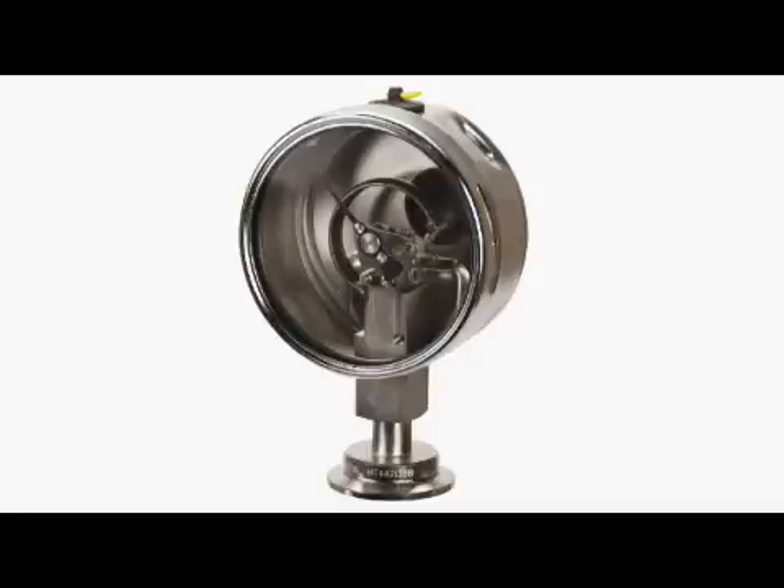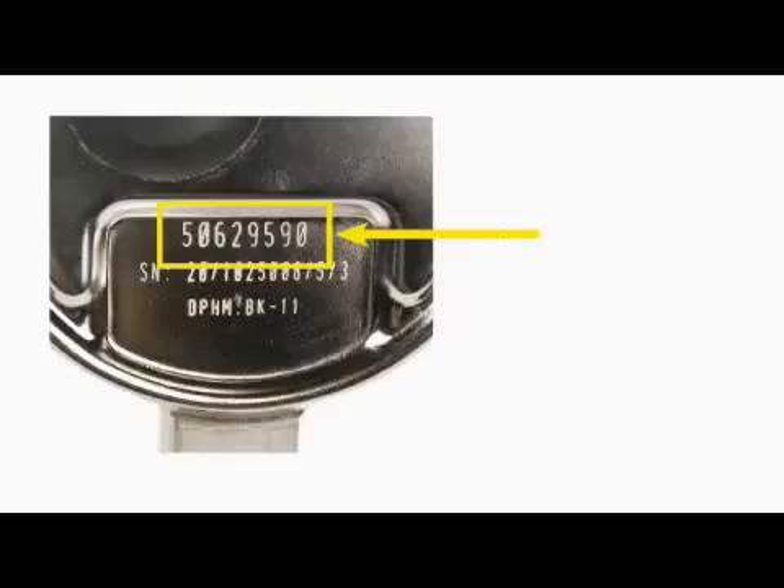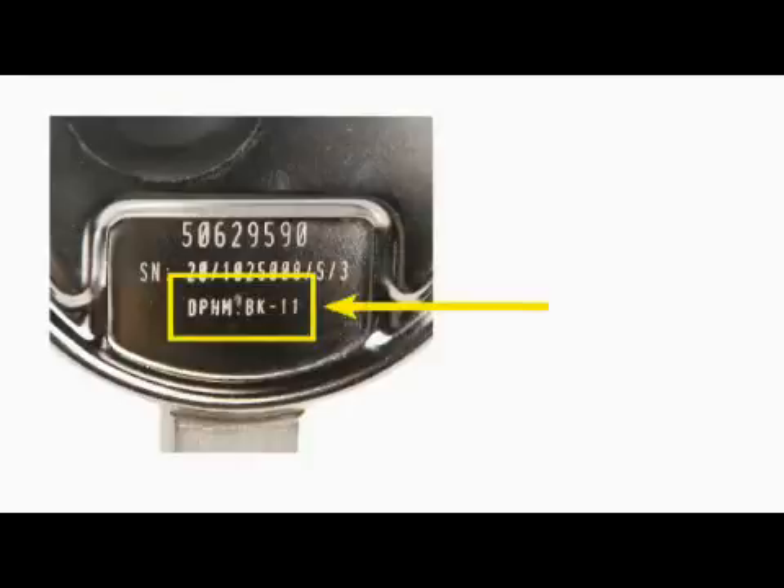Also, if a breach in the diaphragm were to occur, a smaller volume of fill fluid will come in contact with the process media. Material and calibration reports are supplied with each individual gauge. Permanently engraved identification assists in ordering and validation — the part number is a unique number assigned to every configuration, and the serial number is a unique number to track the device during validation and maintenance. This number can also be used to retrieve replacement documents. Heat codes ensure compliance with validation and assist in attaining replacement certificates.